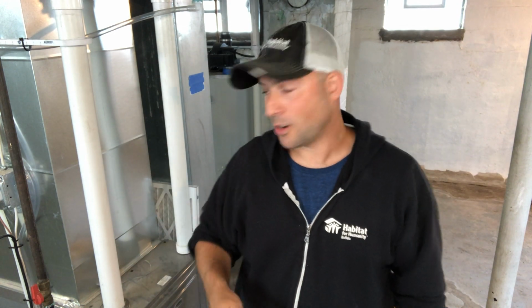Whatever it takes, buy in bulk so that they're always just sitting there so you don't walk by and think, I got to do that later, but next time I'm out I'll pick up a furnace filter. Just buy a bunch of them and have them right next to the furnace so that it doesn't become a hassle, and you can get years and years and years out of your furnace that you might not otherwise if it has to overwork itself trying to pull air through a soggy filter.